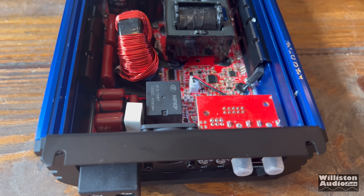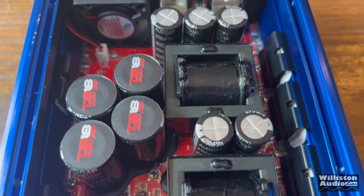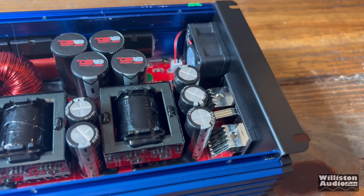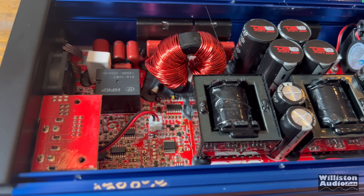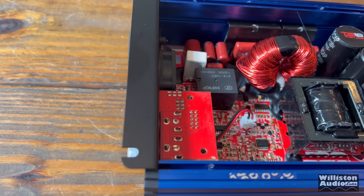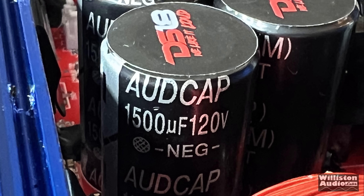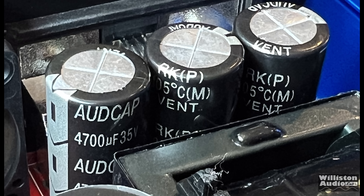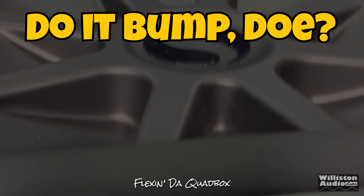Let's take a look at the internals. Here is this mini 3,500 watt amplifier. We'll do a flyover and take a closer look at the components inside. There you can see the transformers, also the capacitors, and the choke at the back. Speaking of capacitors: 1,500 microfarad, 120 volts for the rails, and for the input filtering 4,700 microfarad, 35 volt.